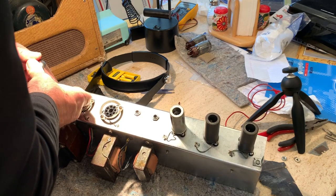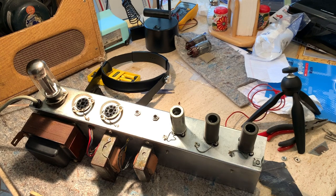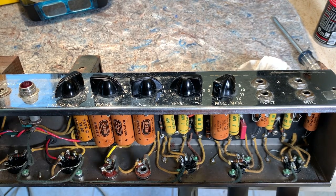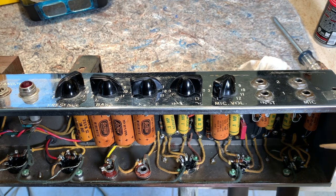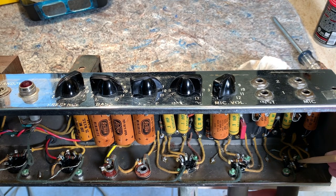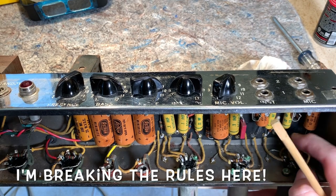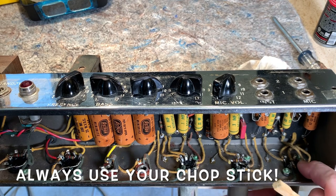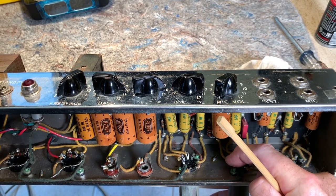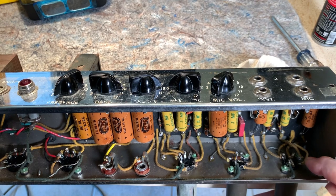Sure, you got a good grip on there. I'm gonna put my bias probes in here to check the bias before we put it back together. All right, I'll put you right here so I can show you what I'm doing. I come in here and I push all these pins back down. Actually, I could do it with my fingers since it hasn't been turned on or plugged in or anything. Just to get those pins down around the tube pin connectors. Make sure they're nice and solid.